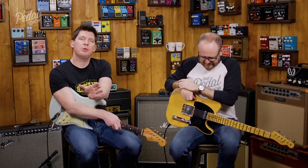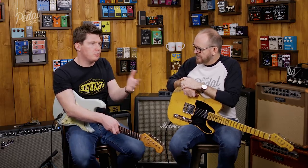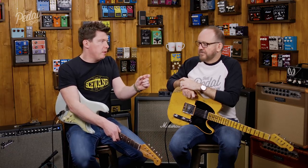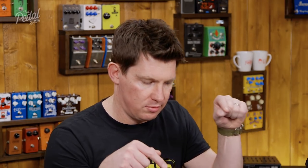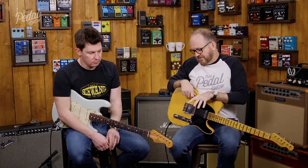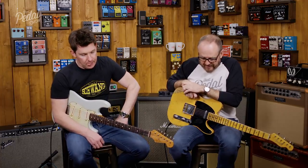Exactly. Actually, at this point it's probably relevant to mention, when we talk about germanium-based pedals, something like a Fuzz Face type fuzz or a germanium treble booster, like a Dallas Rangemaster derived treble booster, don't get that confused with germanium clipping diodes in an overdrive pedal. For example, a Klon has a germanium clipping diode. That doesn't face the same issues in terms of wahs and buffers as these germanium transistors. Germanium diodes and germanium transistors aren't the same thing, because apart from the sonic differences, there are powering issues with these. Okay, so that's the sounds we're looking at.